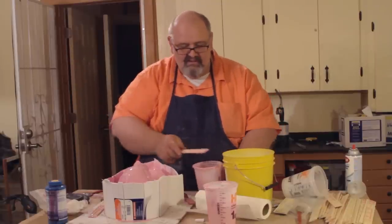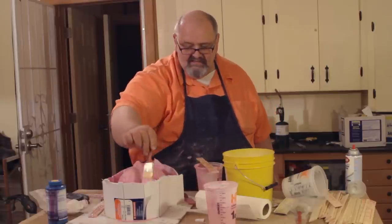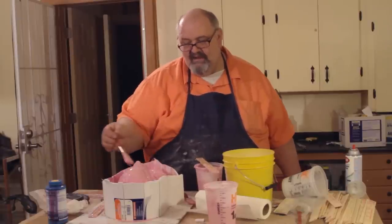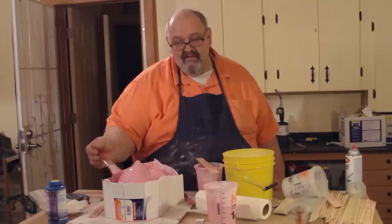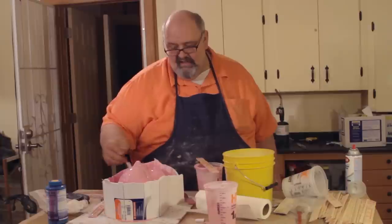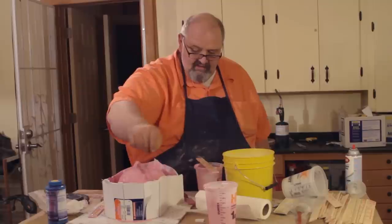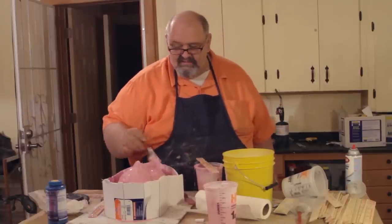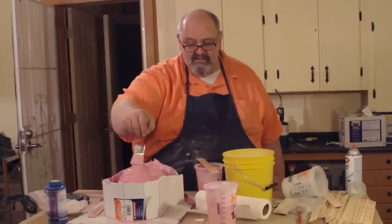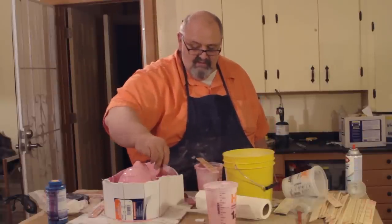For the first 10 or 20 minutes or so, you just want to keep checking it and seeing if it's at a point where the material will actually stick on there and stay without you having to constantly paint it back up over the high spots. That's a pain and it takes a while. But you can go ahead and just get it in there, have it touch the entire surface of the piece. And then if you want, you can wait a few minutes until you notice that it is starting to get tackier and it's not flowing as much. At that time, you start building up the thickness on the high spots. But again, just always trying to make sure you don't let things get too thick anywhere.